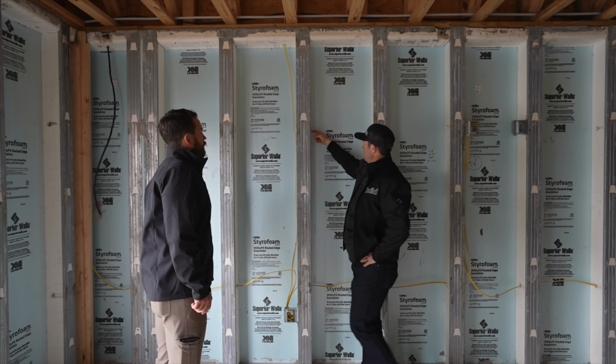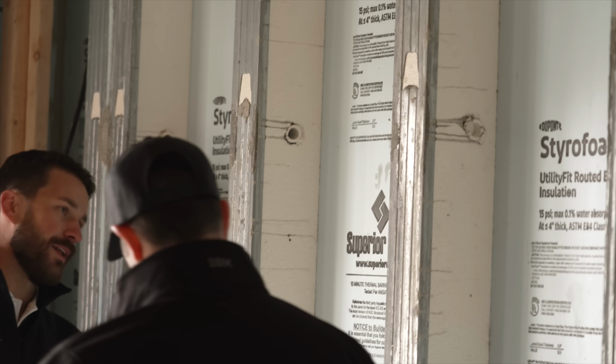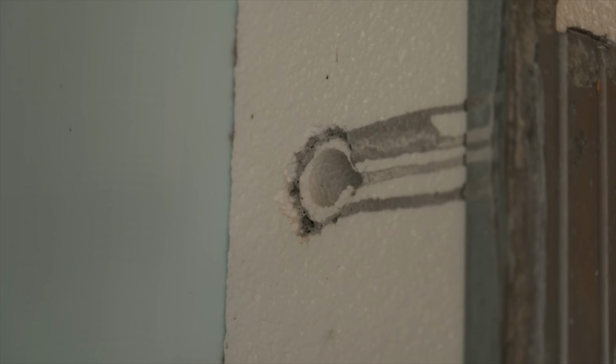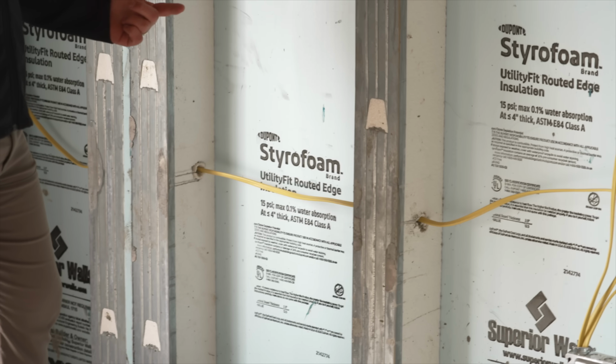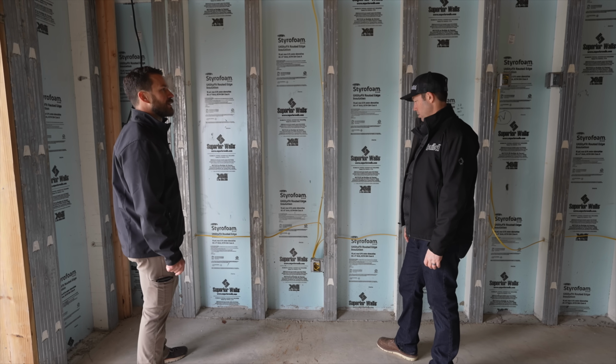And is that a through pipe that I'm seeing there? Yeah. These come already drilled out, so electricians don't have to drill out every hole to pass through like you would on a stud. It makes that part a little faster for install. And if you have any plumbing pipes that are bigger, you can certainly just core drill it with any concrete bit. So that's wild. Makes that part fast.